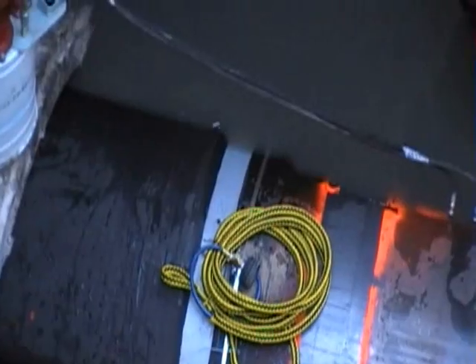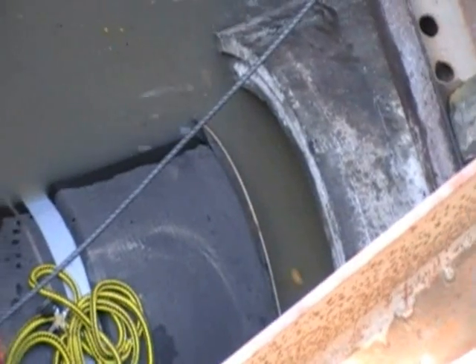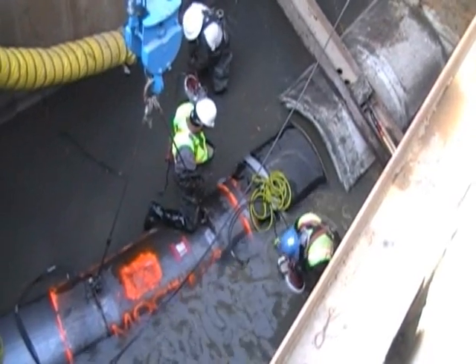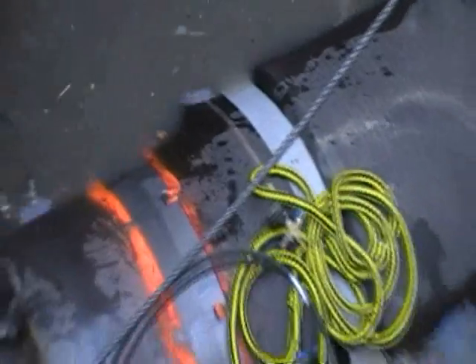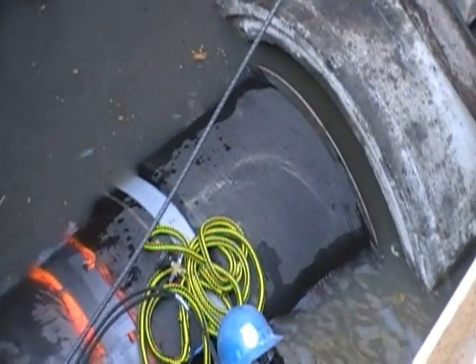The diverter is sliding into place. Once in place, it will be inflated. The upstream diverter is now in place, and we're replacing the downstream diverter. The rubber cuff is sliding on the steel bypass pipe, and the diverter is being hydraulically pumped into place.